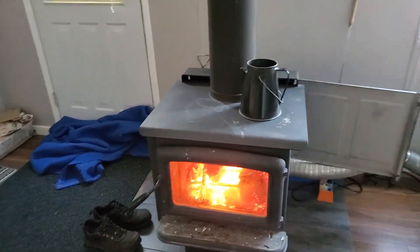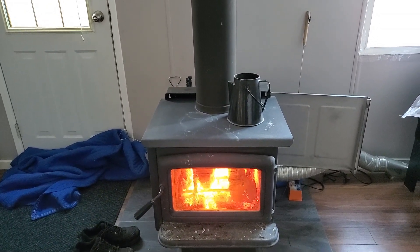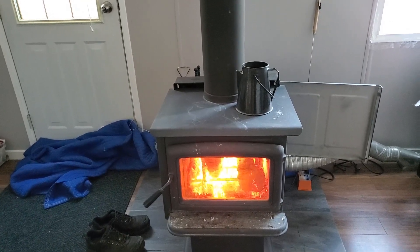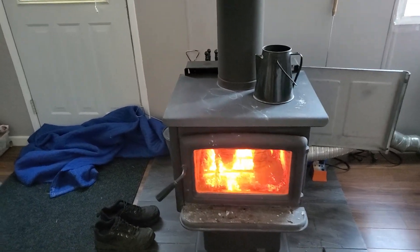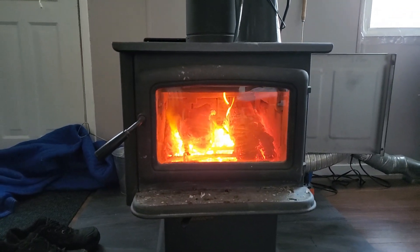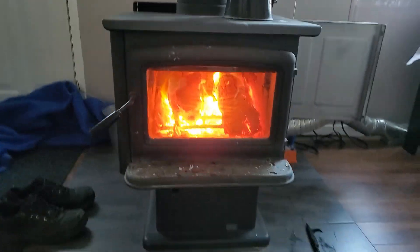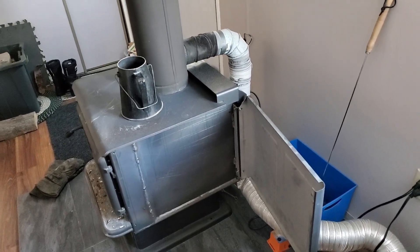We have to be on top of putting wood in this thing. We get probably about a five-hour burn out of it when it's this cold — like, you're down to coals. It's still making heat, but you're not making enough to keep up with the cold. You have to throw wood on there and get the flame happening again because the coals just won't cut it. There's a fair amount of coals and the stove's still making decent heat — it's just not enough to keep up. So if you're going to maintain the heat in the house, you've got to have a flame on. Once that flame starts to go out and it's just coals, it won't maintain and you've got to throw more wood on. Then you get another five or six-hour burn before you've got to throw more on. I'll link the video in the description of the modifications I did to this wood stove, because I've got a whole other video on it.